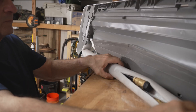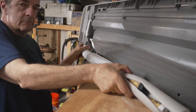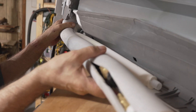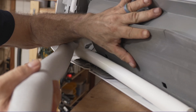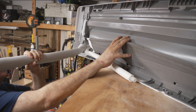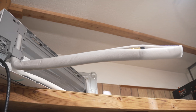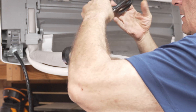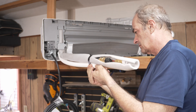You'll need to prepare the indoor unit piping to be routed outside. The line set feed pipe is located near the bottom of the unit and needs to be bent straight out in preparation for mounting the unit to the wall. There's also a drain pipe here, and the placement of the drain pipe relative to the line set is very important. Hold the piping near where it attaches to the unit and very slowly, using even pressure, bend the piping away from the back of the unit about 90 degrees until it's sticking straight out from the back. Then take the refrigerant piping and the drain line and lightly tape them together, ensuring that the drain line is on the bottom. Water doesn't run uphill, and you don't want to create a trap or have standing water in this line.